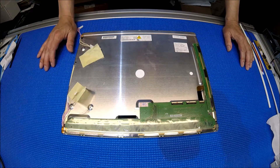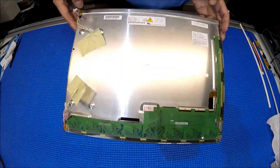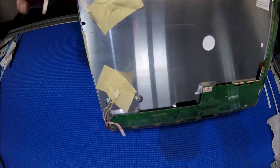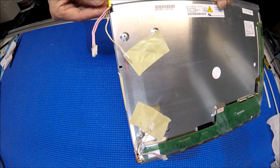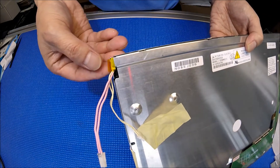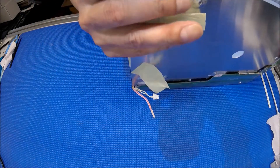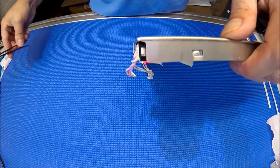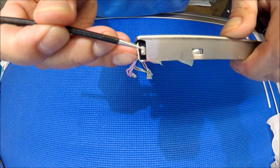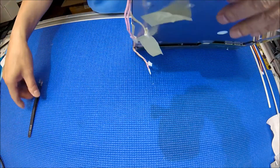For this particular screen, upgrading from CCFL to the UB54 series is very easy. The diffuser is just mounted here. The first thing you need to do is remove this tape — take a close look, you can see the tape covering it. Then push the rubber clips and grab the wire to slide it out.